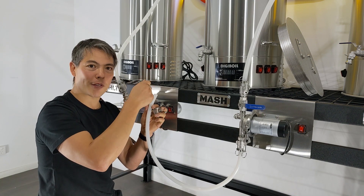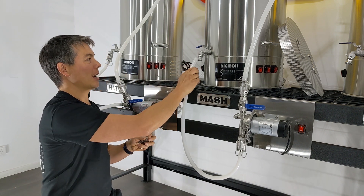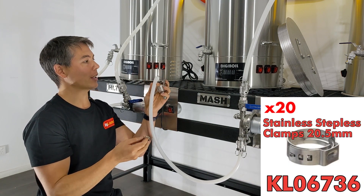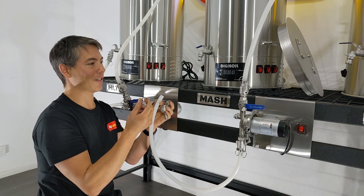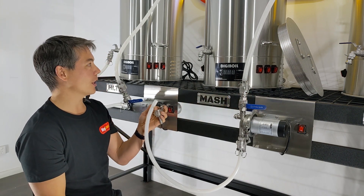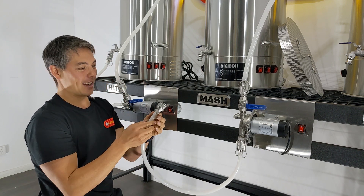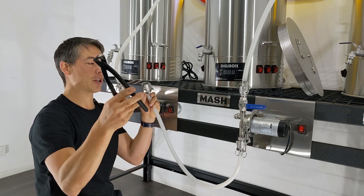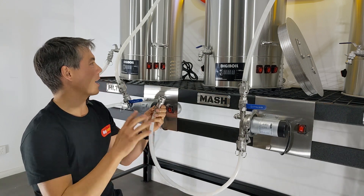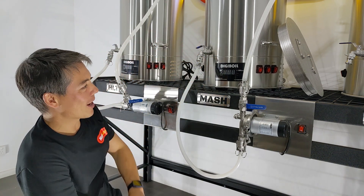To get these on, you can use the worm drive hose clamps if you're the kind of person who's unsure of the system and may want to take fittings on and off. But I've measured these hoses up so they're pretty much the right length, so I'm going to use these stepless fittings. For this type of half-inch silicone tubing, we're using the 20.5-millimetre stepless clamp. These are nice because they give a much more streamlined finish rather than having a big worm drive thing sitting out there, which can sometimes obstruct the cam lock fittings from closing correctly. Make sure to put the hose clamp on first — that's the bit I always make the mistake on — then put the cam lock on after that. Use one of these crimping tools to crimp that stepless fitting down. These aren't reusable, so make sure your hoses are the right length before you join them on.